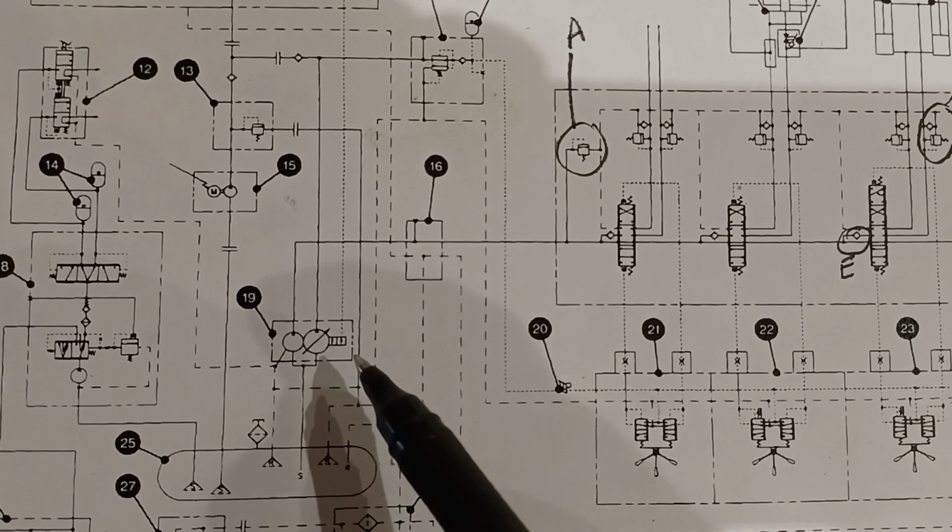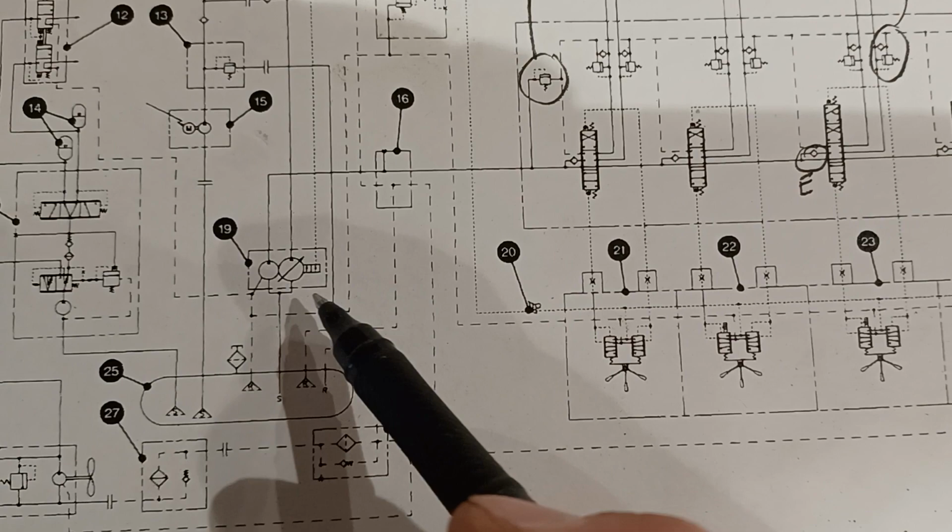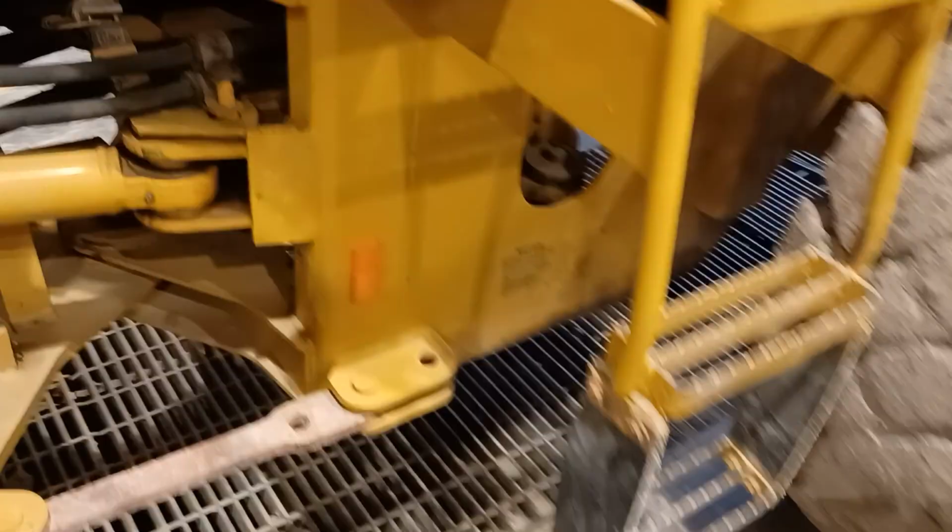It's both a vane pump for implements and an axial piston pump for steering. So there's two pumps together. You can see there's one common housing around them. It's a Vickers pump. They sell it as a combination vane and piston pump. So they're both sort of in a common housing. And we'll have to take this panel off the side of the cab to get in here. We'll see over this side of the frame here, or up in this hole, driven off the transmission. The pumps are up in this area. So we'll have to remove this tinware off this side to get to those.